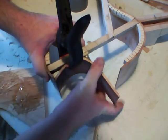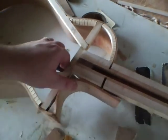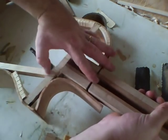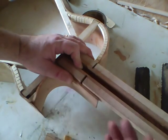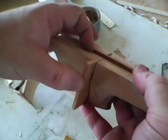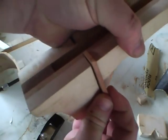Just make sure it's all lined up and it's flush with the top. Then we've gone ahead and made the slot and cut that where we want it to be. Now I'm going to mark where it intersects the cutaway piece, and like before, cut this slot to the thickness of the side. I'm going to take a scrap piece and make sure that it fits in there. Now I'm going to do like before and make a bevel — this is actually going to be a right angle, so you want just nice 45 degree miters here. That will bring it flush with the side of the neck.